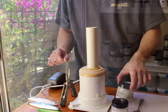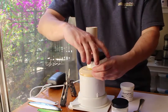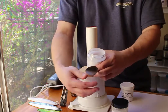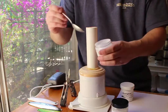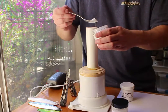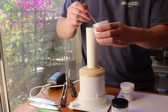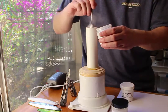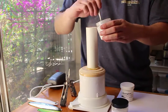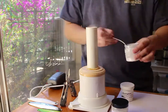The first thing I'll do is fill the tube with plain white powder paint. The best way to do this is to turn the fluid bed pump on medium and add the powder paint one spoonful at a time. If you turn on the air pump after you've added all of the powder paint, the rising air will push a lot of the powder out over the side and you'll lose a great deal of it. So go slow and steady — turn the pump on medium and slowly add spoonful by spoonful.